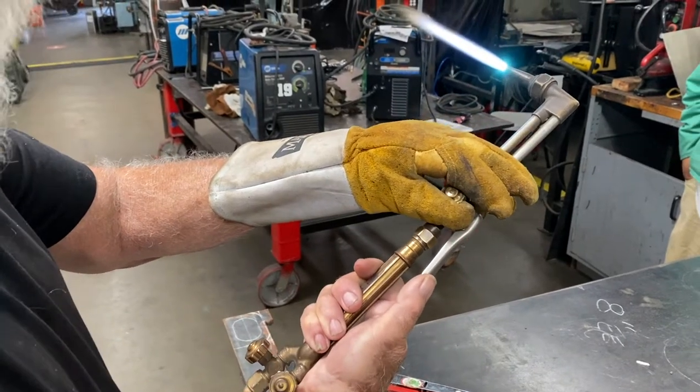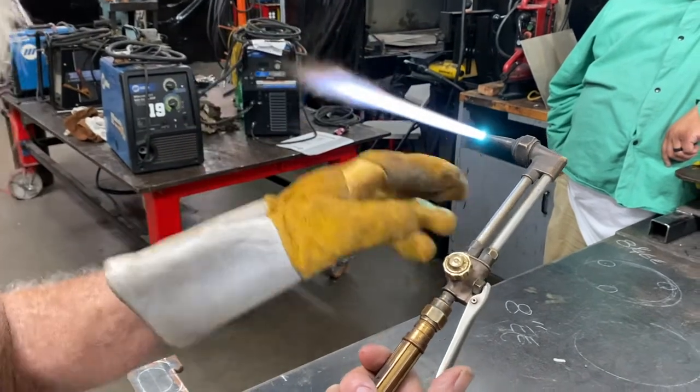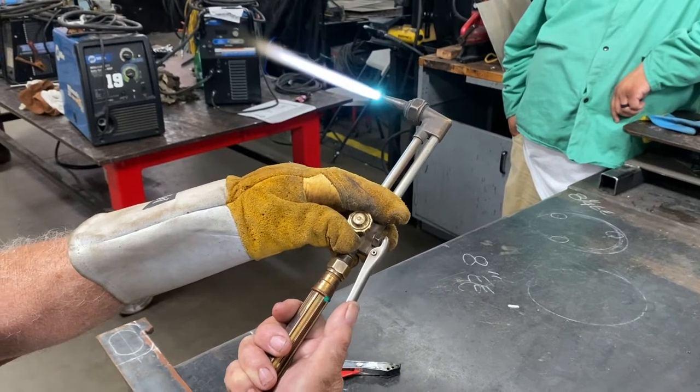So what you do — you bring it just before it comes off. When you bring this down, leave this alone. When you have the oxygen on, you open it up all the way and use the valve as the on/off. You light it, get it adjusted, and pull it down so it's just even with the end — no carburizing flame on it. In other words, it shouldn't look like this — you can see the difference.